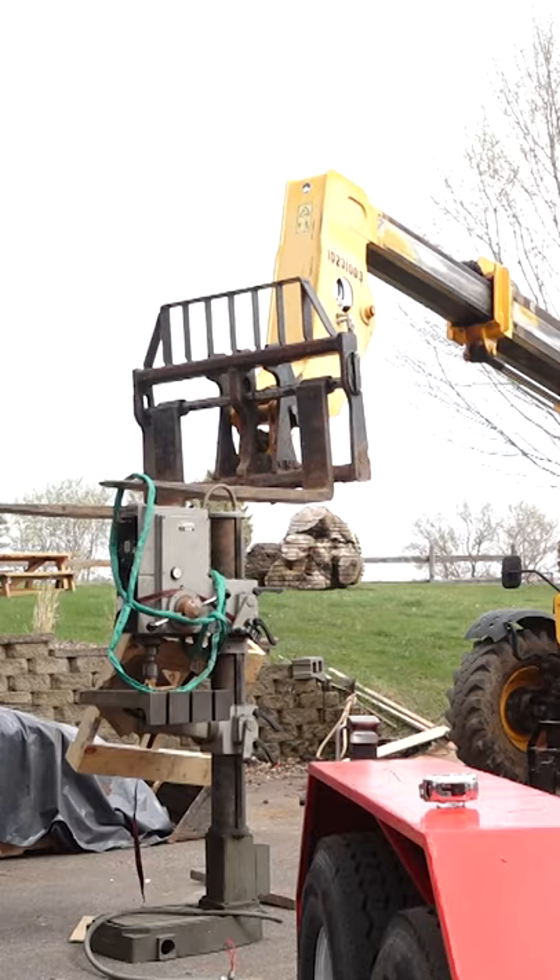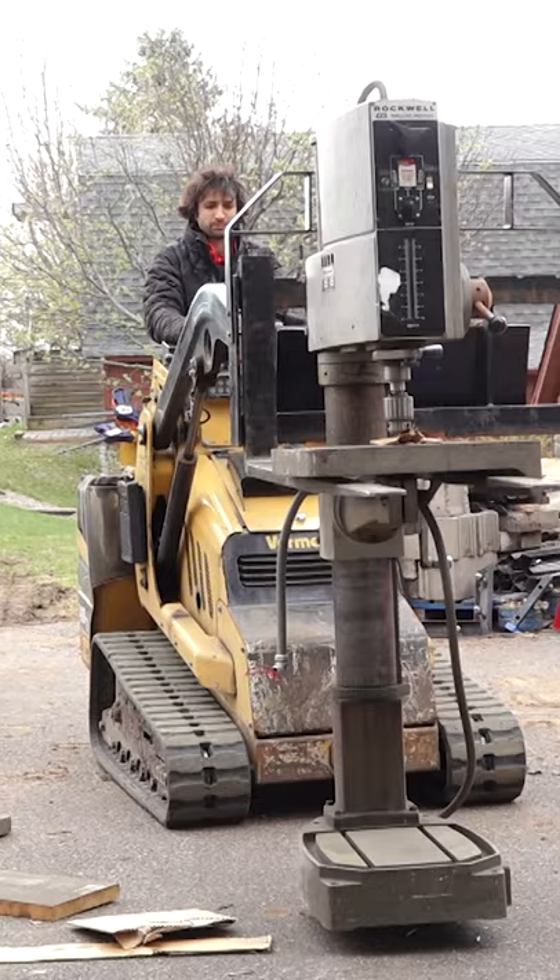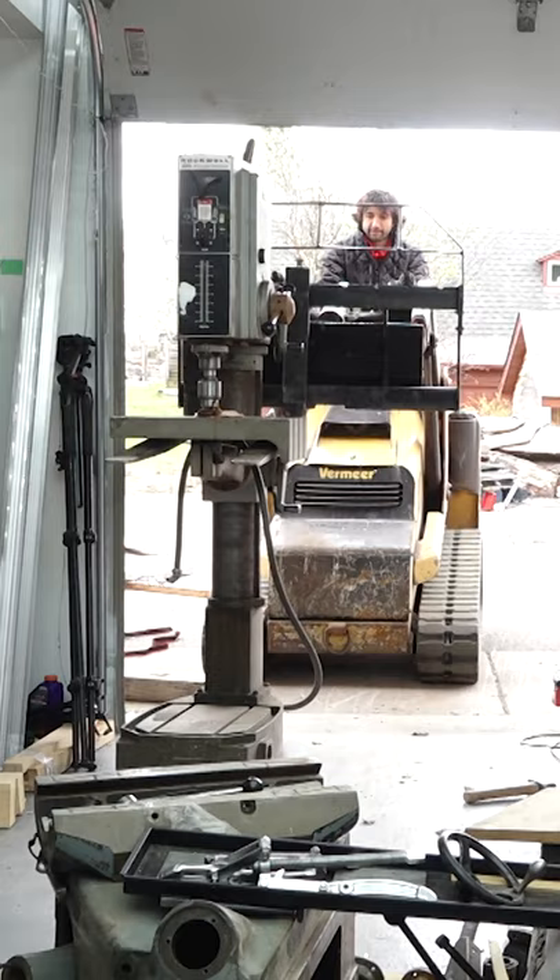It has variable speed through its geared head, and it is three phase, so I'll have to do some work to get power with my single phase supply. Probably do a VFD just like everything else I have. It's a small step in getting the shop put together, but it's a big deal since now I don't have to step over this drill press to get out the door.